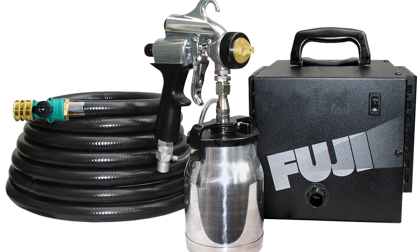If you have an older Q-series turbine, you may notice that there's already a 1/8 inch bleeder hole on the turbine manifold. This can be seen by moving the turbine on its side. In this case, simply open the bleeder hole from 1/8 of an inch to 3/16 of an inch using a drill.